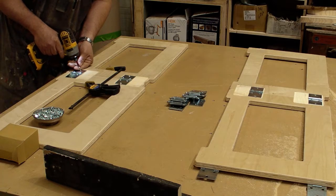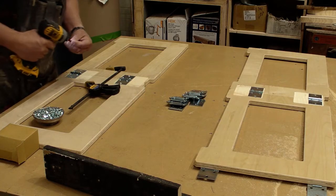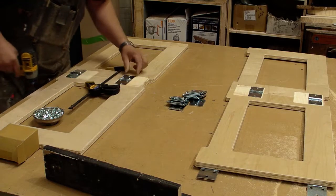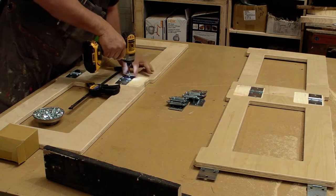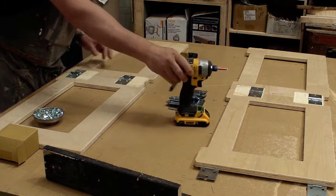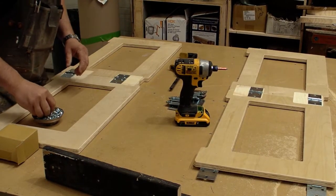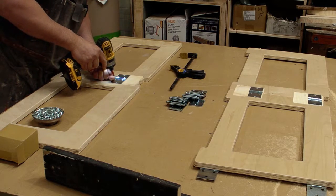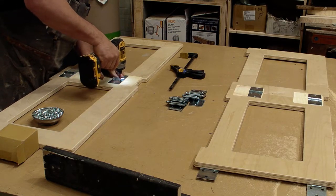And then there's another one where the hinges are top and bottom. I could use a VIX bit, but I really just line the center of the screw up with the center of the hole. The wood screws I'm using are nice and aggressive with a beautiful point on them. Then I check it to make sure that when I close it, they're aligned — because you can get the hinge incorrectly lined up, and then the top and the bottom don't line up when it closes, which is kind of annoying.